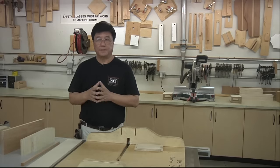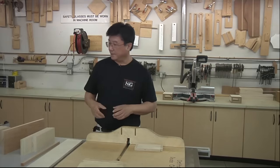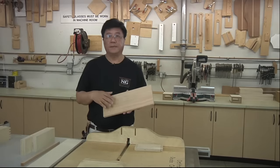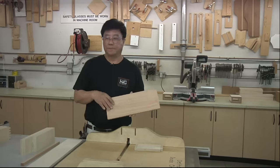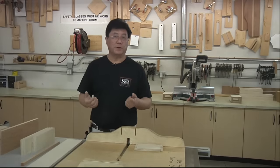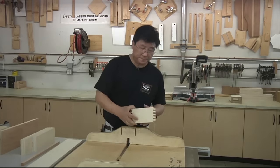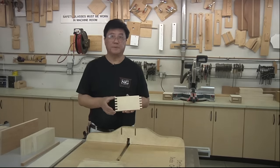When I'm making custom kitchen cabinets, the first drawer on top is usually what we call a 6-inch drawer — the drawer front is actually 6 inches, so the opening is usually 5 inches, with a half-inch overlay that covers the hole. I like to make my drawers 1 inch smaller than the opening to accommodate the hardware and allow room for clearance. So with a 4-inch drawer, mathematically it's perfect because it gives me perfect symmetry.